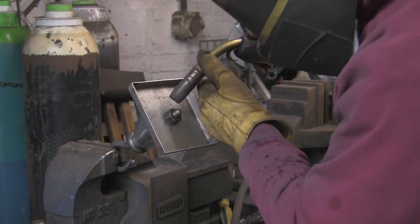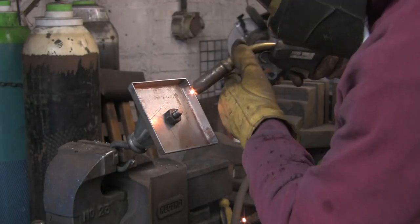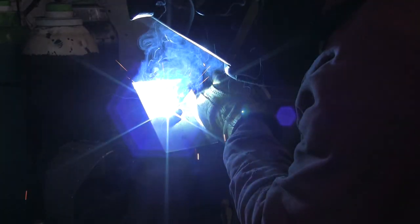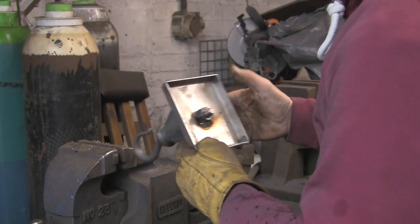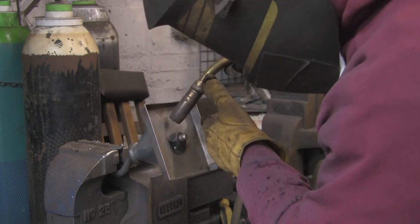So first of all, we'll just whack a bit of weld around this nut. I'm only going to put a couple of tacks, one each side, because I don't want this thin sheet to distort too much, which it can do quite easily if you put too much weld on. So I'm literally just going to do two flats,